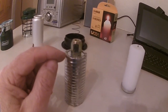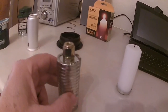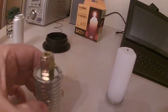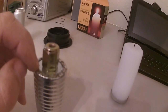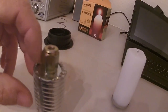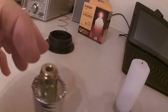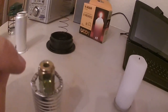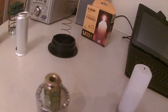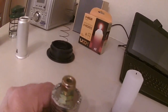There's 2 big washers and 2 small diameter washers, so I could put sealant in there, and I've forced it in the end. I've sort of peened it over with a hammer around this edge, and I'm going to put some of this metal putty round here to make a seal. Now for the centre, it's a brake pipe fitting. I intend to slide a piece of brake pipe down the middle, and I'm going to also use this hole here as a filler. Quite a small hole, but it should do the job to fill it.